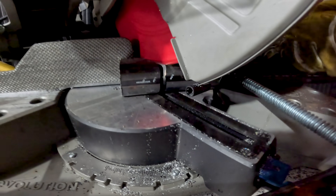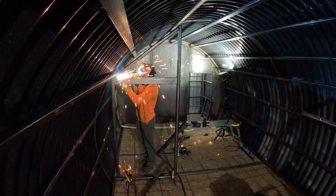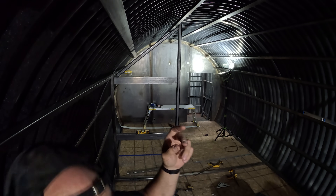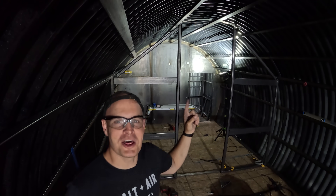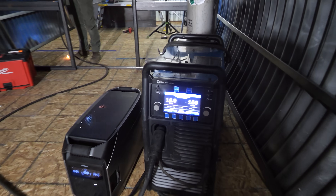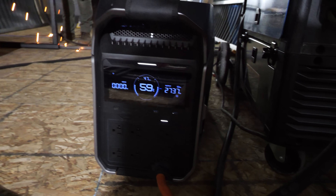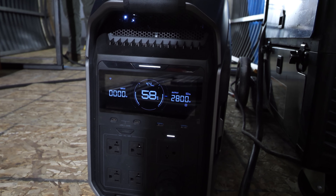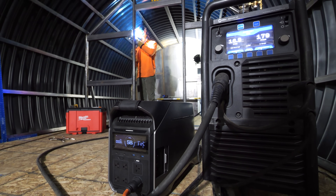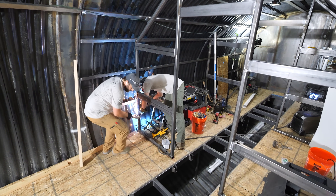It's nice that we can run all of our equipment off a single unit because previously, in order to get 240 volts we had to pair two EcoFlows up with a cable. But this Delta Pro 3 can do 240 all in a single unit. And in an actual emergency or apocalyptic situation where a gas generator would give away your position, this can output 2,000 watts at under 30 decibels, which is about the same loudness level as a whisper. They're calling it the X-Quiet technology. Anyone saying you need a gas generator for the apocalypse is probably just a zombie wanting to know your location.